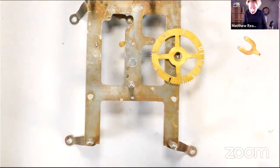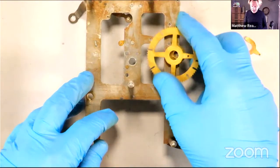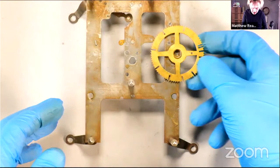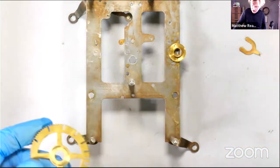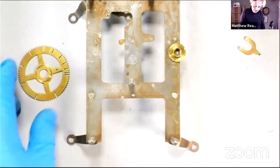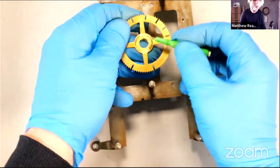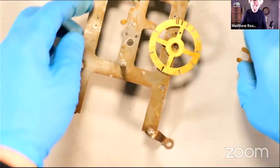So that bears on there. The beauty of not refinishing things in cleaning is that you've got these witness marks so you can actually see where things have been. So a little bit of oil on there. Let's just put a bit of D3 on there. Not the one that's had the stud lock on it. Again, a couple of little drips. Don't need masses. Pop that on there, pop on our clip, holds it on.